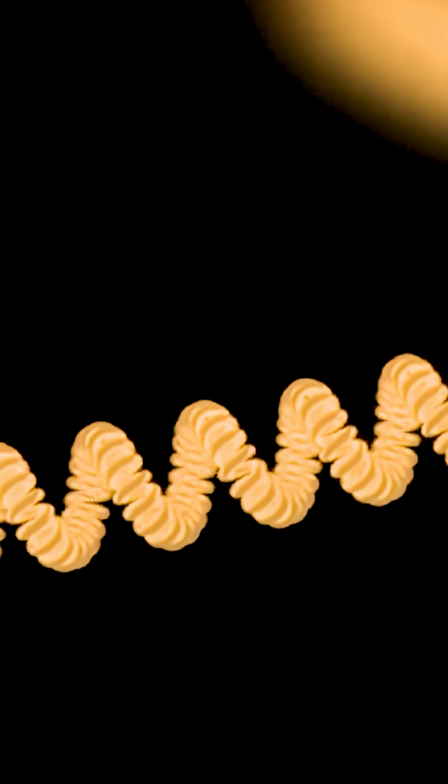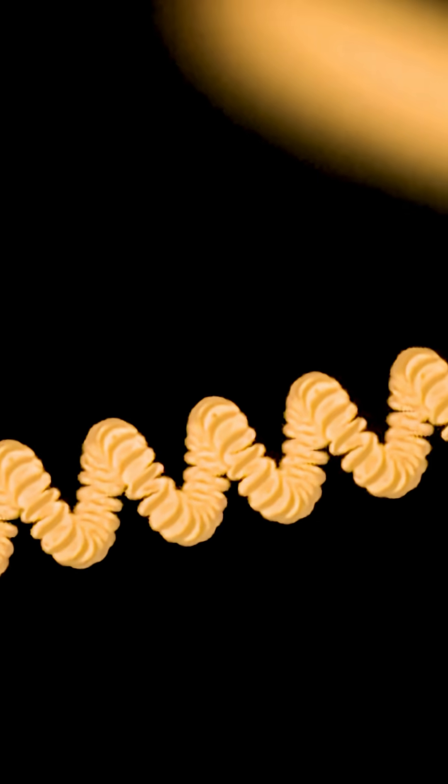The other interesting thing is if you look really carefully, you can see the filament itself moving. Not only is it pulsating in brightness, but you can actually see it almost like a shaking chain or a shaking necklace jiggling up and down as the thermal expansion and contraction of the metal happens. You can see it physically moving, which looks really cool.